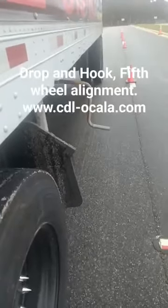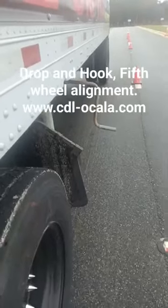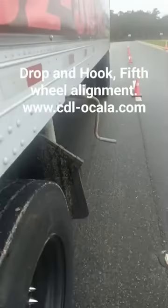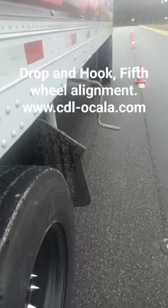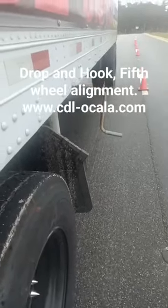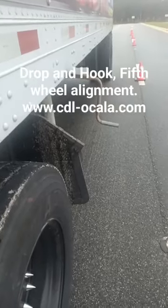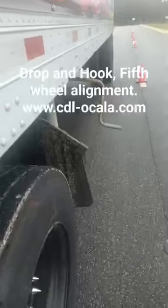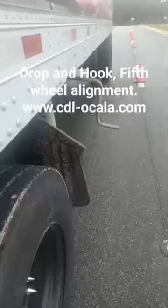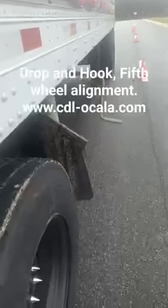Usually they'll snap because they're not made to support that. A lot of these things, like the door handles, the hinges on the trailer, and these components here, are made to be sacrificial. So if I back up and hit that crank handle, that weld is going to snap because it's made to snap. It's not going to support the weight, and then I can damage the frame or whatnot.